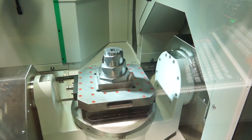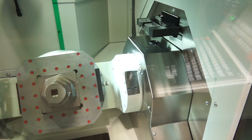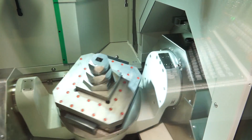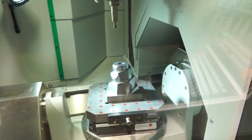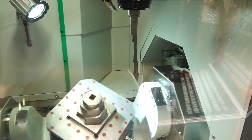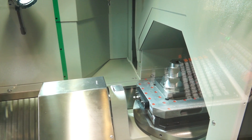So what are you going to be machining on this type of machine? What sort of applications? Mainly we have a lot of steel works, special for the mould and die business, and also graphite works with high accuracy. So would you be taking deep cuts or would it be lots of smaller depths of cut at higher speeds? The main effort is to have a high precision surface — no gaps or marks.